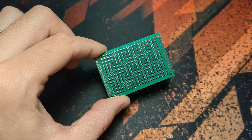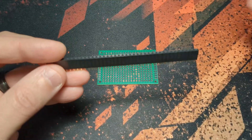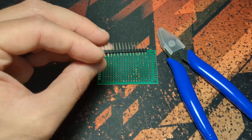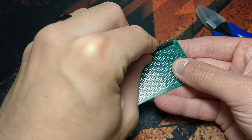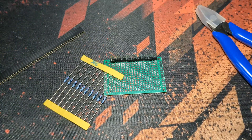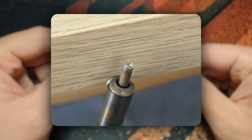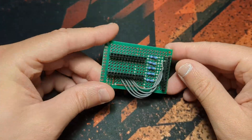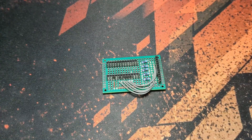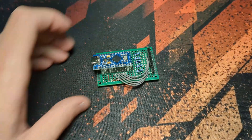To make things a little nicer and with a more modular approach, I'm going to build a little circuit on this perf board that has headers for the 10 input wires, and deals with the resistors and ground line, so that I can easily swap out the controls for any five-button circuit I like. Using headers cut to size, I can solder them so the Arduino can be easily added in a clean, removable way. I've got grey wires going from each pin on the Arduino to the positive side for the buttons, and then a 10K resistor on the ground side. Now I can just connect the test board up and plug in different buttons to get the same result.